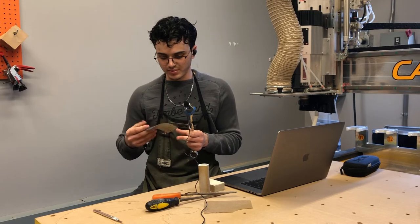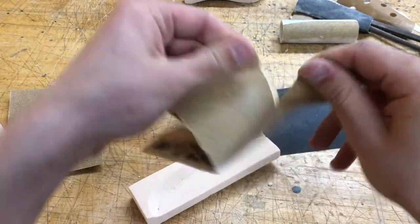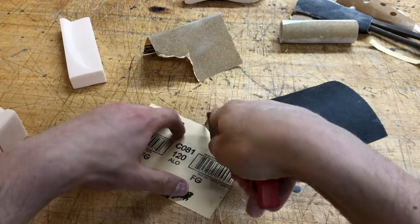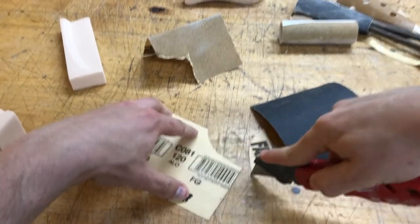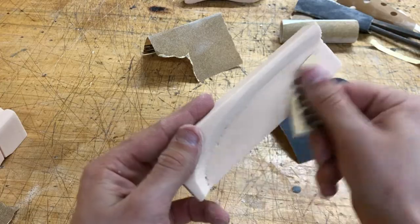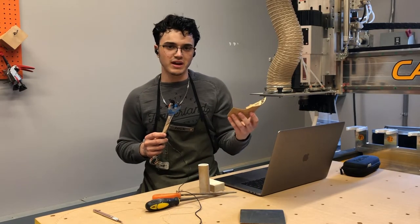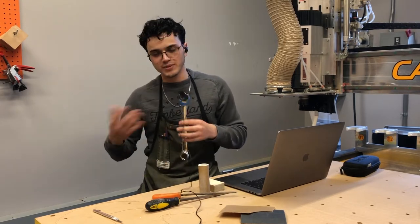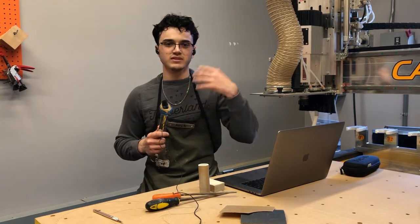You can also rip or cut sandpaper to any size — if you have a curve with known dimensions, cut your sandpaper to that size so you won't have a corner tearing at the foam. You can do this with any grit. You'll probably end up with all sorts of little scraps, which are usually easier to handle than big pieces, so don't be afraid to go through sandpaper. It's cheap and it's really helpful stuff.